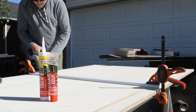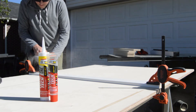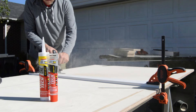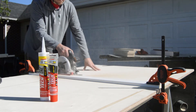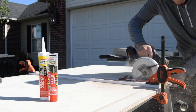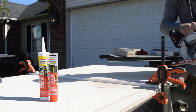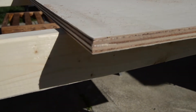Step one — I had everything sketched out for the headboard as far as the overall height and width, so let's get this three-quarter ply cut to size. For all you makers and DIYers out there who don't own a track saw, I learned that a piece of MDF trim is a perfect guide for the circular saw. This piece of MDF was perfectly flat, and I keep it on hand when breaking down plywood. Make sure to invest and maintain a sharp blade on your circular saw — based on this cut, it's time to change my blade.